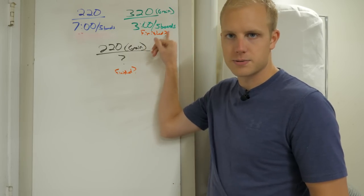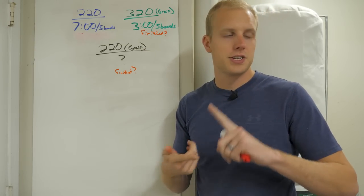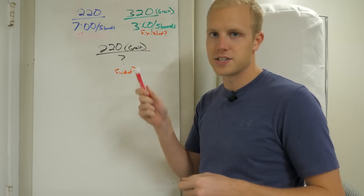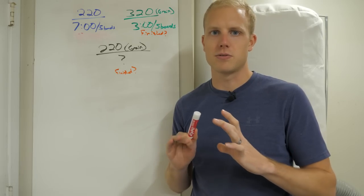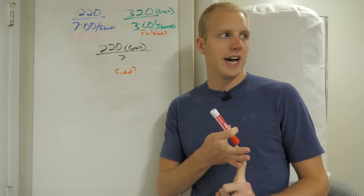So yeah, I wanna see the difference between the finish of these two boards. So I'm gonna find another 5, 3 maple, 2 ash, just so it's the same wood species. I wanna see if I can just raise the grain straight away before I ever sand. So tool finish with raised grain at 220 and see what that looks like.